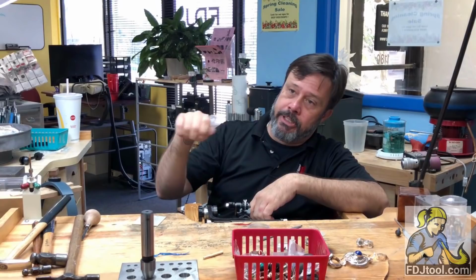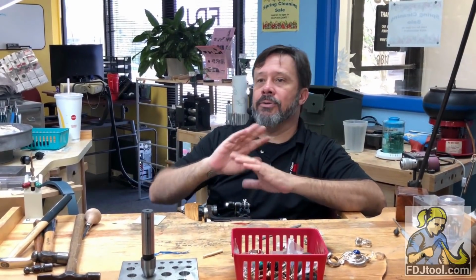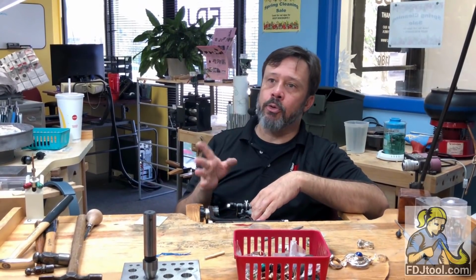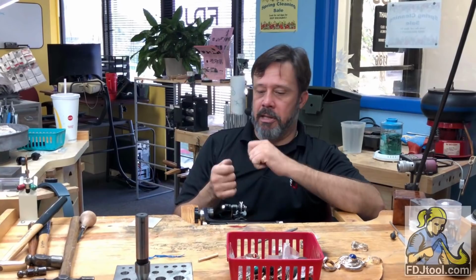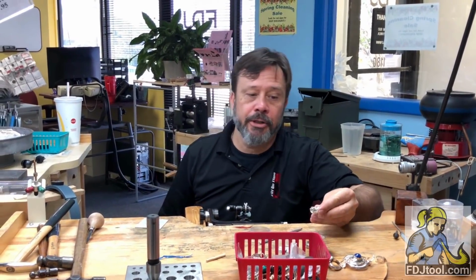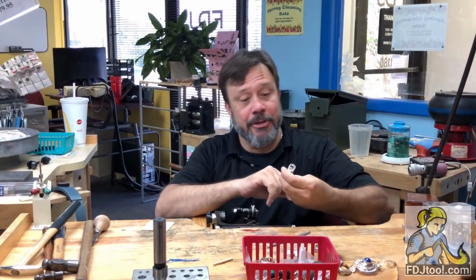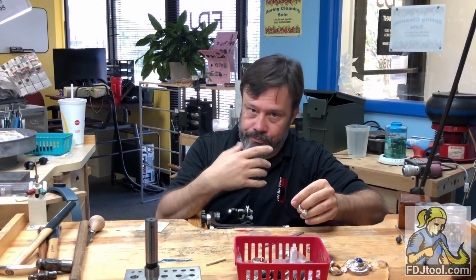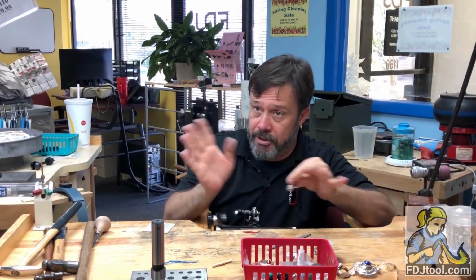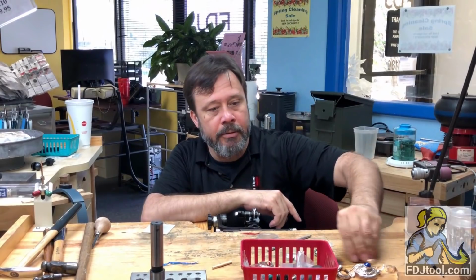And then I take those bristle discs and go over the whole surface, and that rounds everything out. The bristle, the little paintbrush type things. Go really coarse, get the yellow ones, the 80 grit, and that removes all the sharp detail and blends everything and smooths it together. It makes it look a little more natural. Those are the ones with the little fingers on them from 3M. Yeah, those are really good about taking little things and smoothing them into the rest of the project.